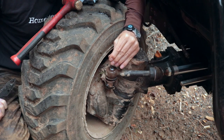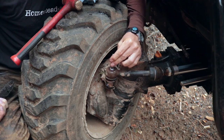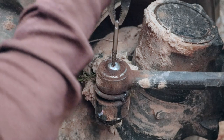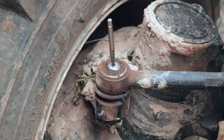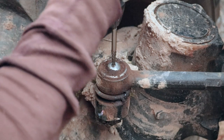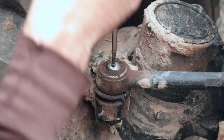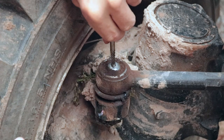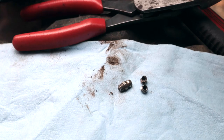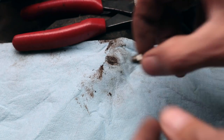I've got the easy out in the hole and just have to make sure I don't cross-thread it. This is not at all what was expected to happen, but this is the way life goes sometimes. It's coming out, slipping a little bit, but I'm just going to take my time — it's a very delicate process because these are very tiny threads. Voilà, there's our little piece. Here you can see the two pieces of the broken grease fitting — I have two because both sides were broken off. Here's a new one; let's thread that in and we'll be back in business.